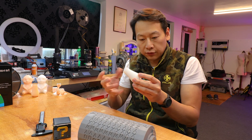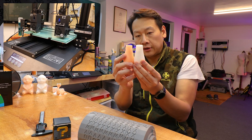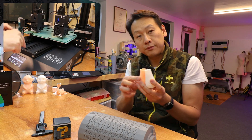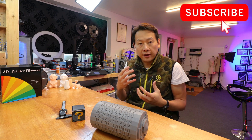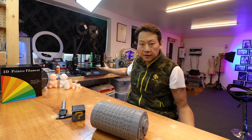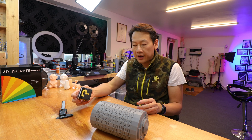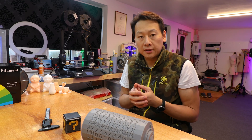After a few prints, we tweaked the settings and then I started to get more consistent results like this one. And this one was printed from a mirror function, and this is why this particular model is a bit more expensive than your normal printer. I put a Creality black glass on top and then the adhesion problem is solved. So now when I print PLA, it's stuck to the glass properly. Thank you to some of the Facebook user tips.